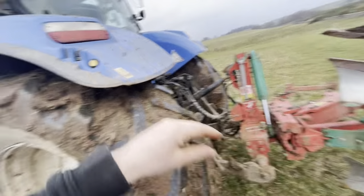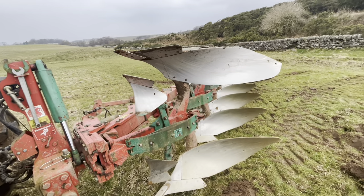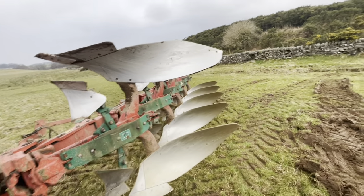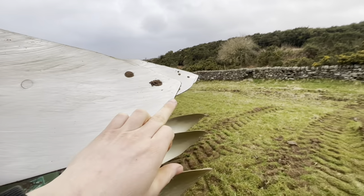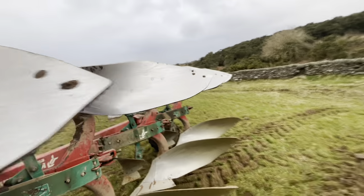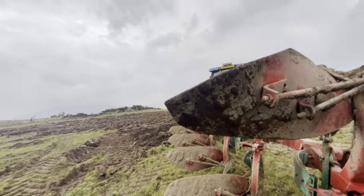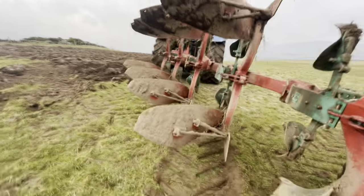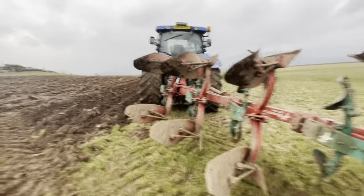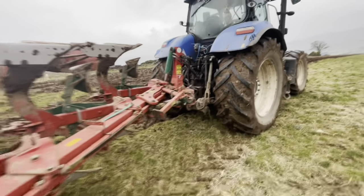I'm not sure if the fluffy thing's doing its job or not, but I'll soon find out when I watch this back. If I lift this up, take the pressure off the plough, you will see this. Now, each mouldboard's supposed to be able to look down the line and they're all directly in line like this. But come to the back here — if you look down the line of points and the line of these, I think it's actually okay this way. I think it's when I flip the plough over. I think it sits alright this way round. It's when the plough's flipped over — that's the bother.